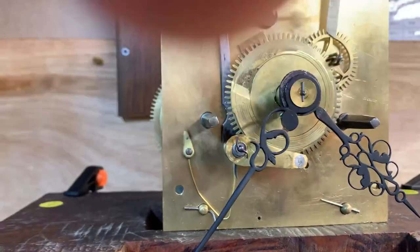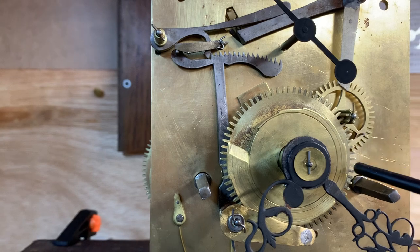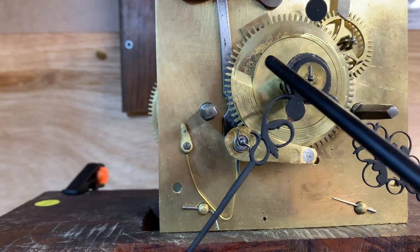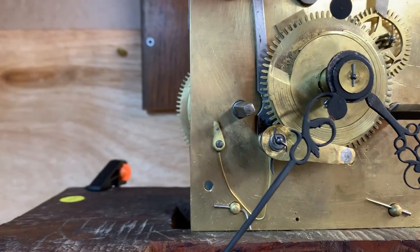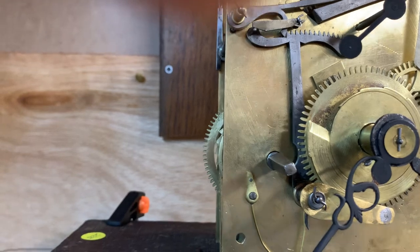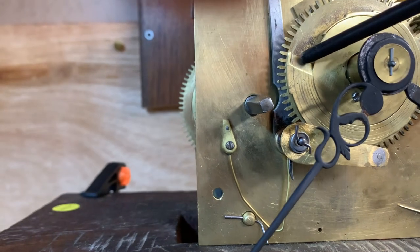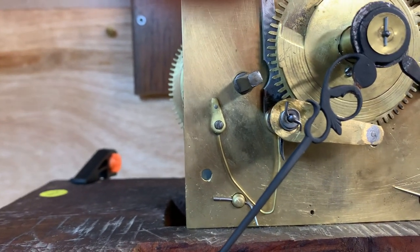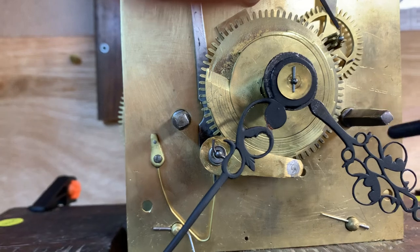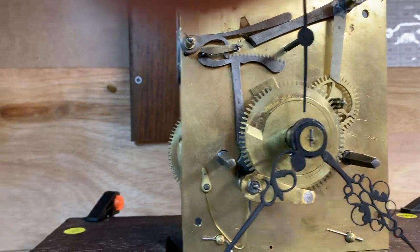This part here is shaped like a snail shell, and the lever we're pointing to here - whatever position it lands - that's what adjusts where this rack is in order to give the amount of strikes needed. So for instance, if it landed here it's going to be 12 o'clock, here it's 10 o'clock, eight, seven, six, five, four, three, two o'clock - that's the general plan.